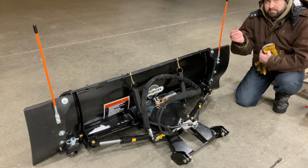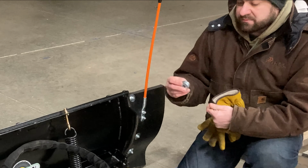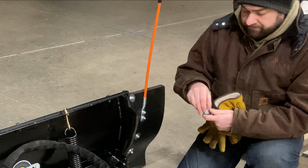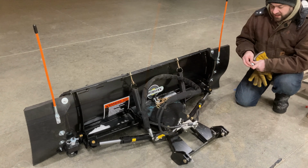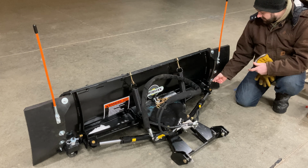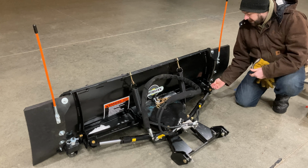the pin clip and several of the washers. So I went to Tractor Supply and got some washers. You can see I was missing about this many to level it up. I got a little bit thicker washers and a little bit thicker pin because I found on the other side that the pin was also really close to coming out and it was really bent.